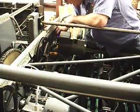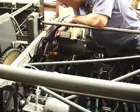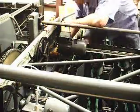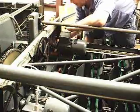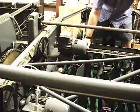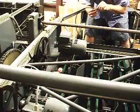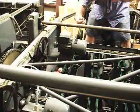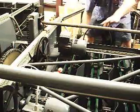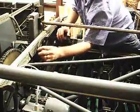I'm going to back this set screw out a little. There is a key pin in here, so don't lose that key pin. It just pushed right on. I brought a dead blow hammer in case I needed to move it — I was going to pry against the side wall or something like that, but I don't need it at all. I'm going to take my belt and do a quick inspection of it. It's looking rough, but it looks like I can get some more work out of it. There are no chunks missing out of it.